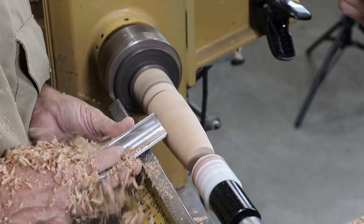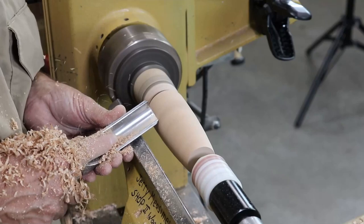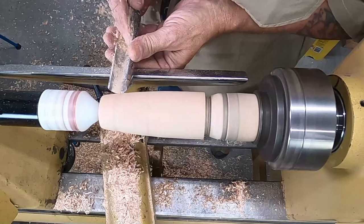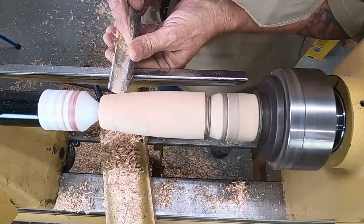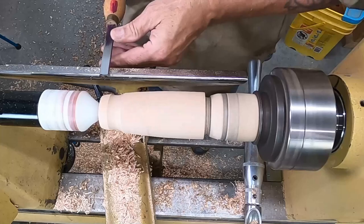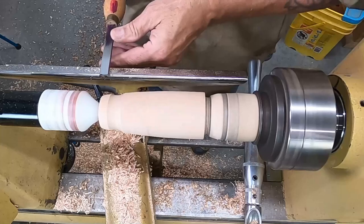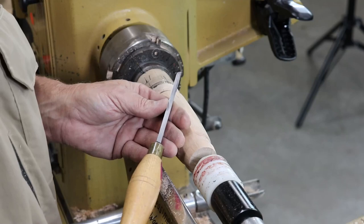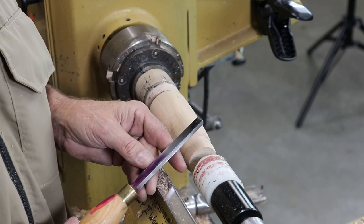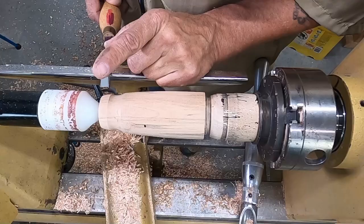Okay, we should be feeling pretty good now — sounding smooth. I like to put a little decorative piece on the bottom, so I take the roughing gouge and just end it in just like that, real slow, and make that little curve in there. Now we're going to bring out a new tool — this is a cove. This is a Sorby beading tool. I got this tool in 2008 when I first started. The tools last you a long time — I don't know how these companies stay in business with somebody like me who's had the same one this long.